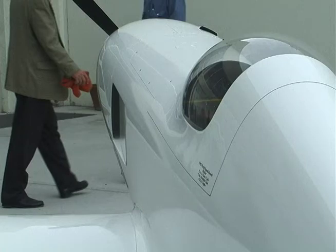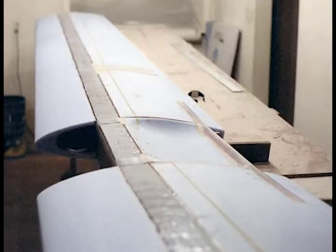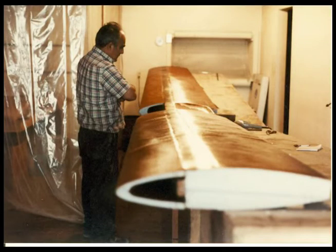Sir? Would you describe the spar for me? The wing is essentially the same as a Long-EZ wing. It's a C-section spar. All fiberglass, unidirectional cap strips, and bidirectional web, and a solid foam core wing. Although I'm saying basically, it's actually got a hollow leading edge so that I can run control runs and hydraulics. Any other questions?